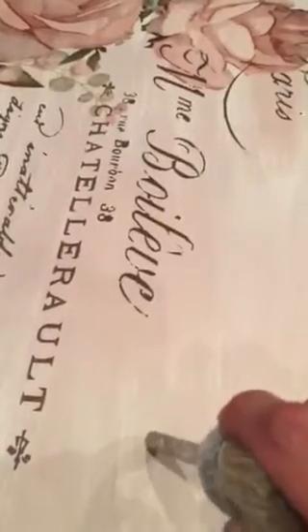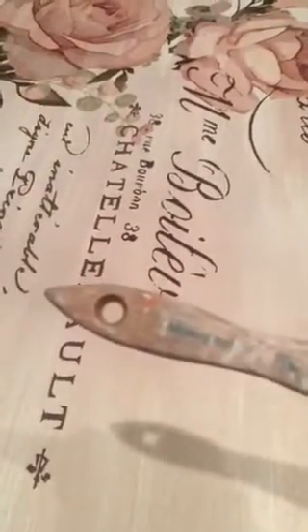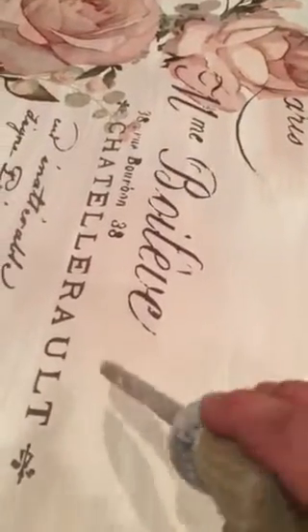My point is to show you that you can paint surfaces besides wood and it really does hold up. I'm going to show you with this paintbrush tip — my fingernails are too short to make dents — so I'll show you how well it can hold up. Don't be afraid if something's painted, even veneer. It holds up well if it's painted right and sealed properly. I sealed this with General Finishes sealer.